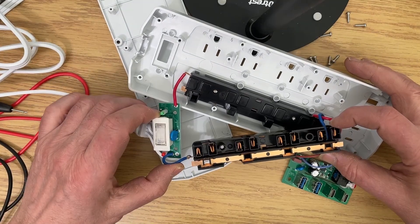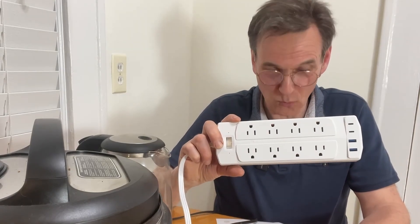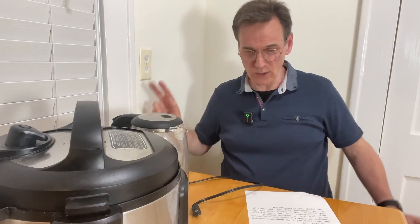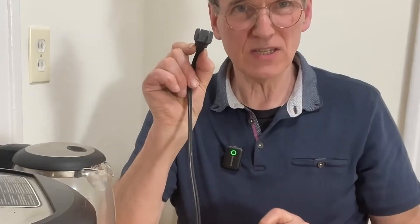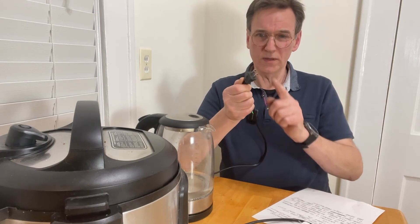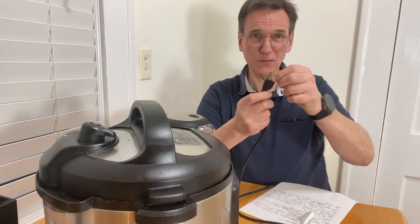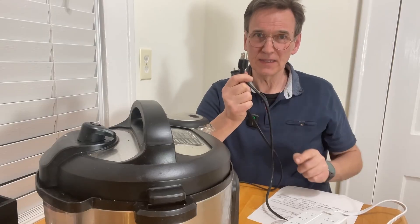If you use one of these things, you have to use it with caution. I received this free in exchange for a review on Amazon and I gave it the lowest possible rating. This is a potential hazard — you could get electrocuted or it could be a fire hazard. If you have these old two-slot outlets and it's your property, the best solution is to change them to modern three-pin outlets. If you can't do that, be aware that many devices have polarized pins designed to prevent incorrect insertion — and some come with three pins. If you've taken away that ground pin, you're bypassing that safety feature.